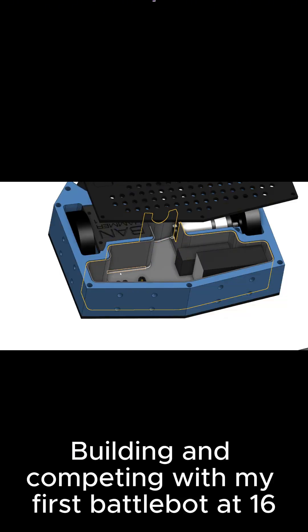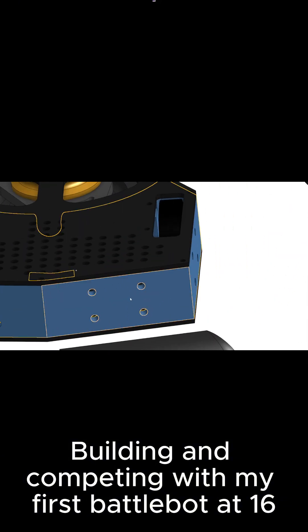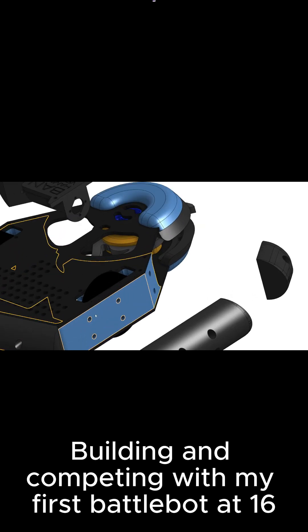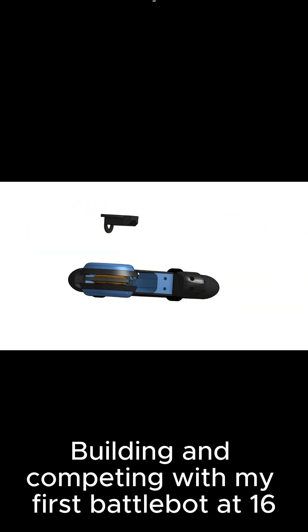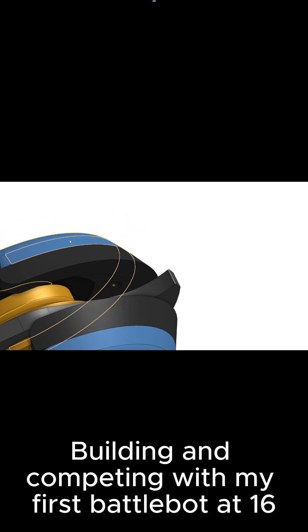This liner is about a millimeter and a half thick and it's not really going to get touched. Then you have these bumpers — the coolest part of the design. I screw them into the chassis with some 3mm heat set inserts and put them all on there. I also have these front bumpers that screw in through the plate, and I've got heat set inserts there too.